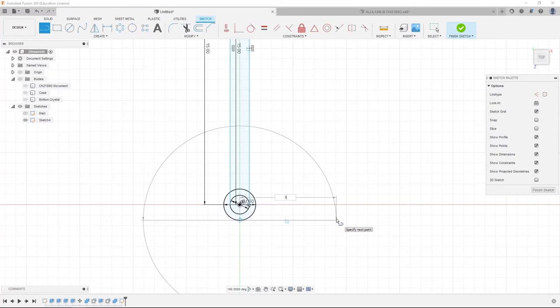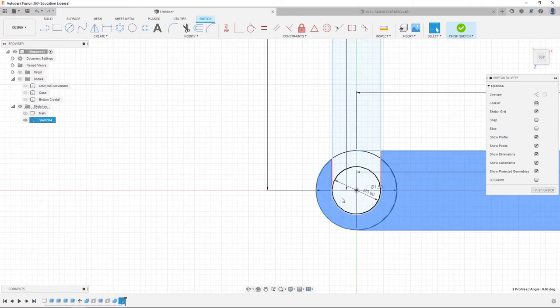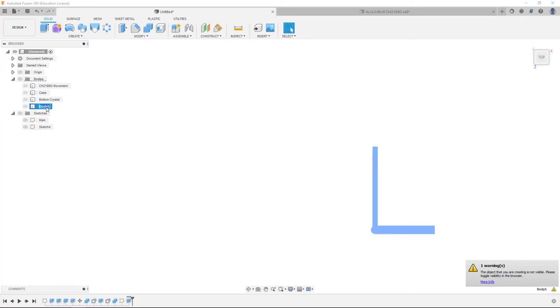Click a line, go 10.5 millimeters, do the same on the top, and close off that one. Now we're going to select all these little faces, finish sketch, and hit E. We're going to make these one millimeter tall. We're going to name this body 'hands' and name the sketch 'hands'.